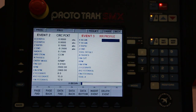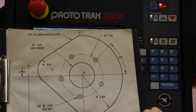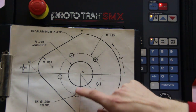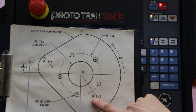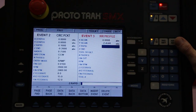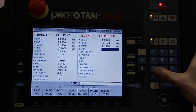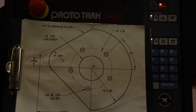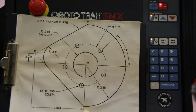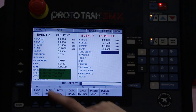We'll start off down here and climb mill all the way around the outside, since it's a CNC. Our start point will be down here. On the x-axis, right is plus and left is minus; on the y-axis, up is plus and down is minus. So X remains at 0, but Y goes down the radius of this arc at negative 2.45. We'll start at 0 and negative 2.45. Rapid down to 100 thou above the workpiece, and this time we're going to go right through the quarter inch aluminum plate — 0.25 negative. The tool will be on the left side of the line, so number 2 for tool left.